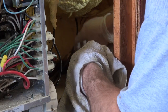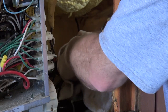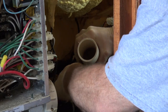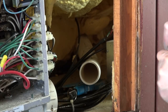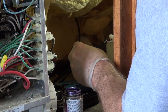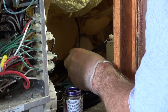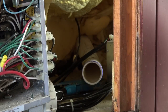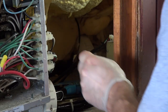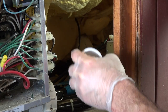Now I'm going to clean this pipe up and make sure it's nice and dry. I'm going to prop it up so it doesn't get water back on it. Christie's Red Hot Blue Glue is the best in the industry — it's what we use exclusively in our service department. When you're gluing new to old, I always purple prime it. Some people purple prime all of it — new to new, new to old — but I don't normally purple prime new to new, though there are people who would argue that you should. We're going to let it dry and get tacky — it'll take just a little bit. Then I'm going to glue this on, spin it till it stops, glue my other piece on, hook it back, and we're back in business. Just that simple.